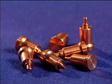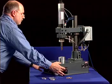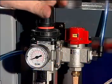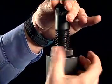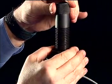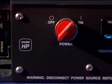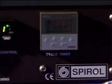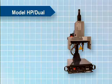Easily interchangeable heat tips. Pneumatic installation with pressure regulator and flow controls to control the insertion force and speed. Simple up-down adjustment of the machine and the micrometer style insert depth adjustment assembly. Solid state electronic controls with 24 volts DC PLC based operating system.